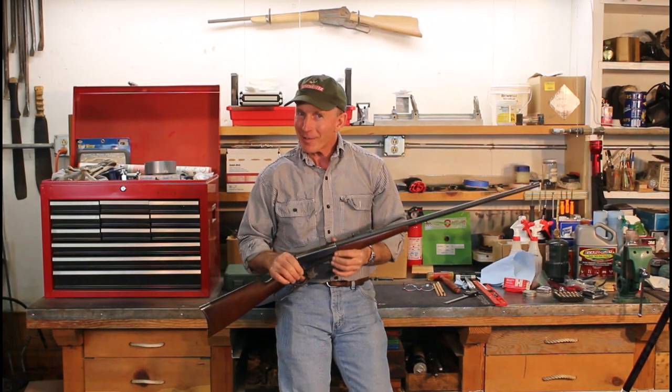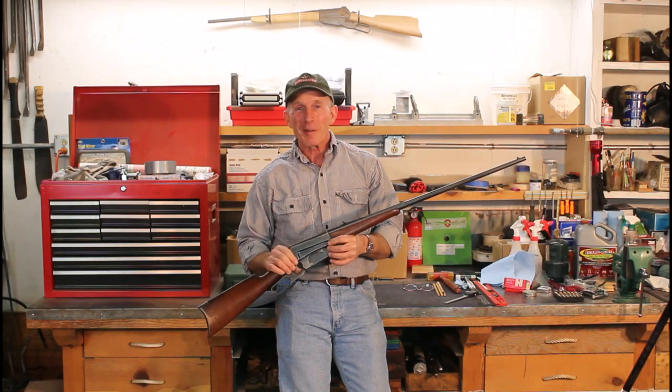While I was working on it I was telling you I was getting a hankering to take it out and shoot it. The only problem is I don't have much ammo for 38-72 right now, and what I do have loaded up has a bullet diameter of .377, which is the factory spec for 38-72. I just never have much luck with any of these old 38-72s spinning those very well and stabilizing that bullet. If you're shooting too-small diameter bullets through these things, it's not spinning them well, it's shaving them, and leaving lead in the bore.